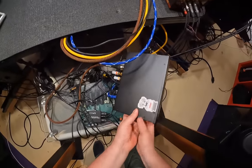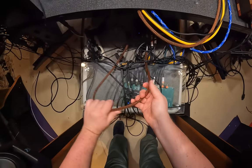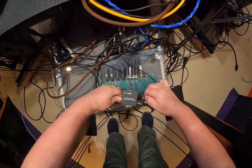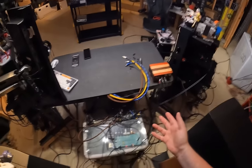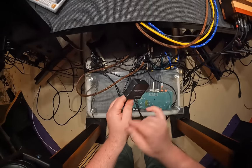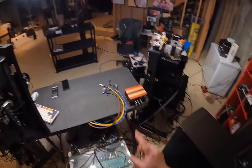So this is my source - I wouldn't even call it my sound card, it's just converting digital to digital. Under here, under all of this, under the wonderful guise of fiber optic splitting - because even though I have all these outputs, these are the ones I need to use on the desk. The Pure Go and all the other stuff that sits around needs to have signal get to it, and I only have one fiber optic out on the SU6. So I have this digital audio splitter, one-to-five - one in and five outs. Then I have another one of those over there for splitting, and another one for splitting. You can split almost as many times as you feel like with fiber optic because it's just re-amplifying the signal.